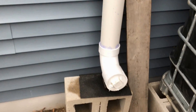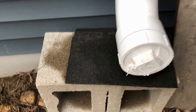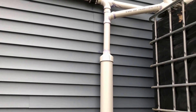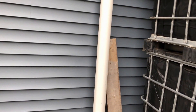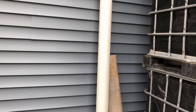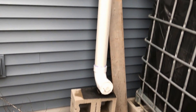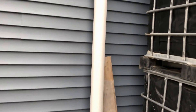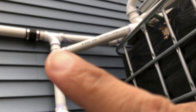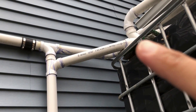This is about three and a half inches, and I can open it and close it if I need to. Basically, water comes from the roofs and goes inside this pipe, so that if there's any dirt on the roof, it stays down here. Then, if it's closed, the water starts flooding all the way up and it feeds through this pipe back into the tote, and starts filling the tote.